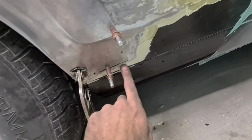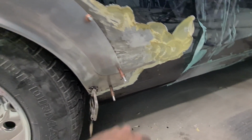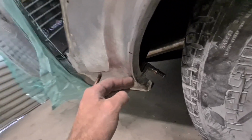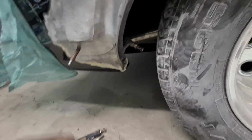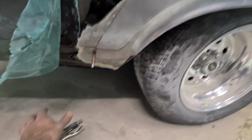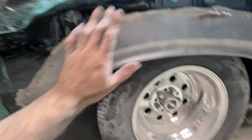So I should be able to join it along there pretty well. I've got access from the inside, so I should be able to bump that line and sharpen it up. I can weld all this on. The backside, it's going to fit alright. Here is where they've sucked the inner's right around, so I've got to fudge this arch and bring it in a touch more to suit their wheel arch. I don't really want to go remaking all that because then it just spreads further and further, so I'll make it suit what they've already made. It's already got inner wheel arches welded in the whole way as well, so just trying to prevent making more of a mess. Ideally I'd start again with the whole quarter, but it's an already painted car, so we'll just get it done.